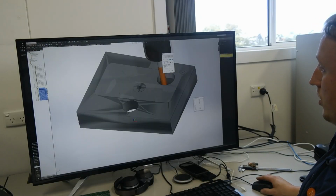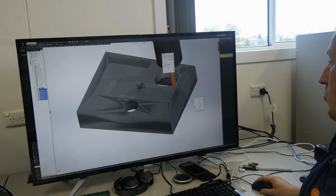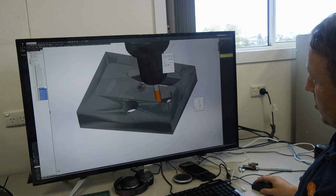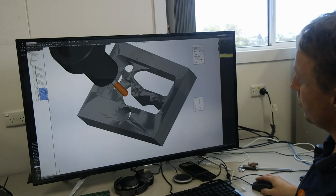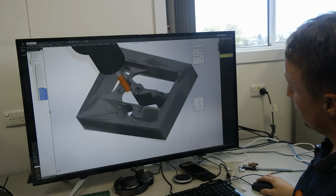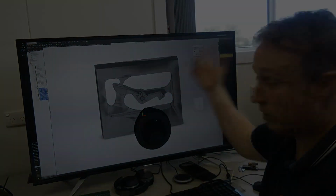First off is the facing operation, then it whittles away, same fashion as before. Pretty much does all the same machining operations as on the other side. You can see there's some places here where it can't quite get the tool into. It's not a real problem, I'll finish that with a file. This support material I'll cut away with a bandsaw and finish by hand.